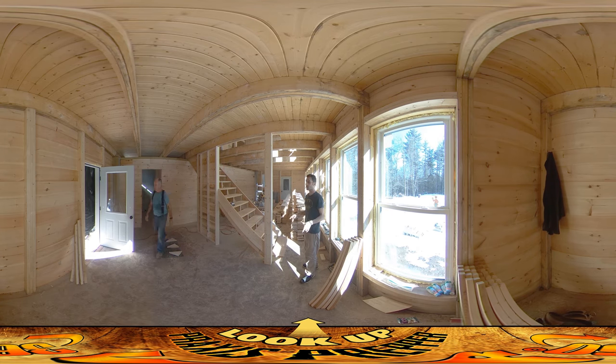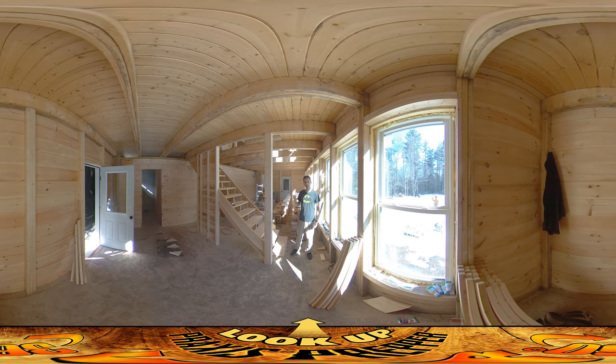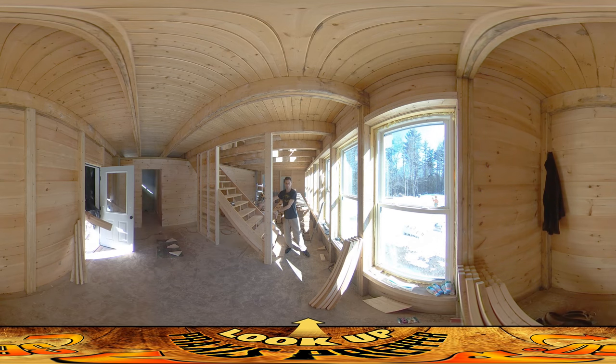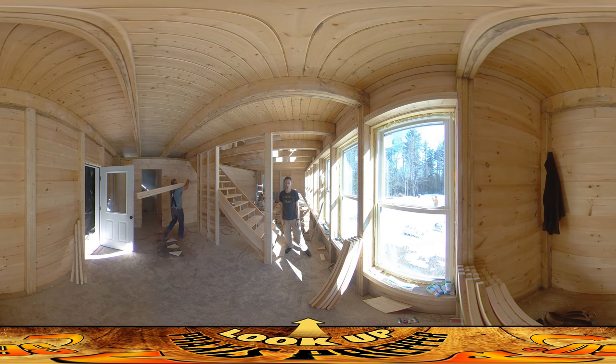The reason I wanted to shoot here, in addition to all of that, is specifically because this is not where this post was originally supposed to be. In fact, this staircase is not where it was originally supposed to be. Because making the stairs that much higher would have made them illegal according to code, I needed to add an extra step in the run, which pushed the run of stairs an extra 10 inches.